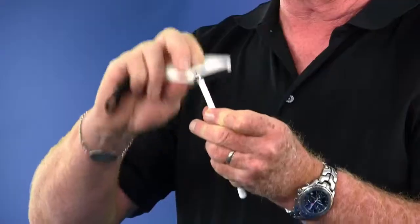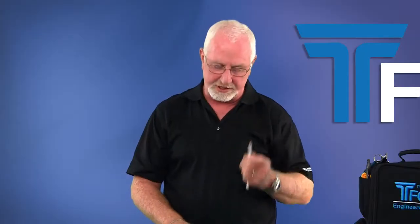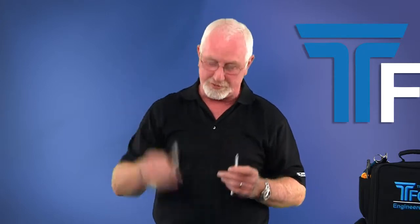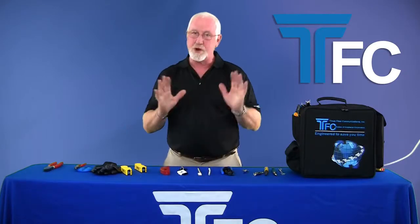Now it's very important to get the braid down evenly because the proper prep makes the connector going on easier. And if a braid brush isn't available, my old standby from my days as a technician was a stiff bristled toothbrush. Make sure it's not your wife's or somebody's from home. All right, you prep the cable.